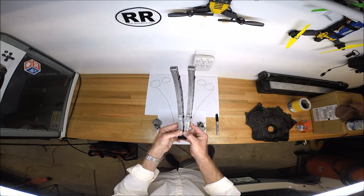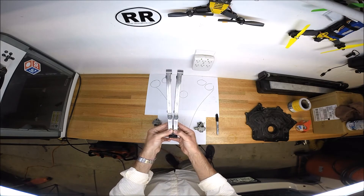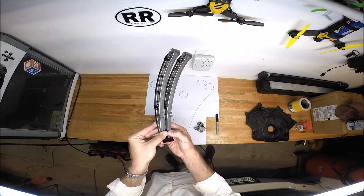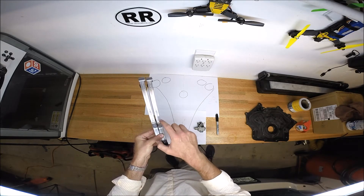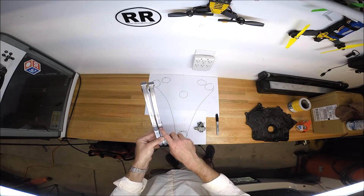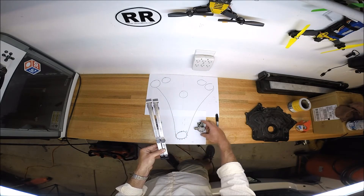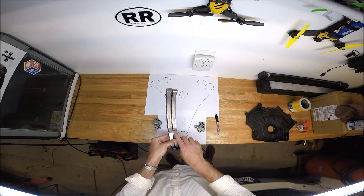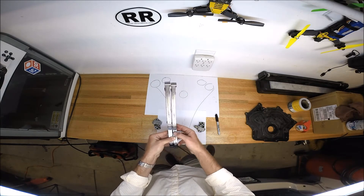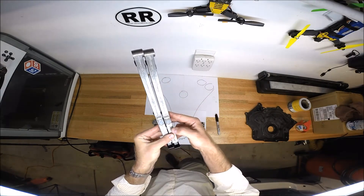It happened on both guides. The new guides — I didn't see a new guide myself — but I was told that this area is machined out and there's an insert with a steel bearing that provides a more adequate surface. They also said the tensioner is angled a little bit more to accommodate a slightly off thrust angle. But really it's quite an extensive wear pattern: steel versus aluminum.